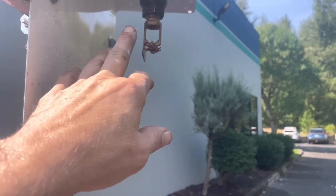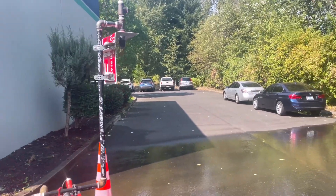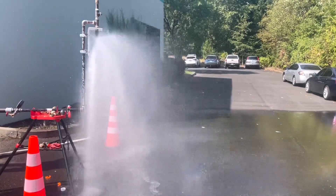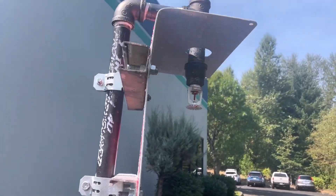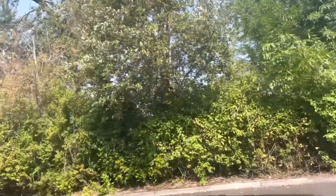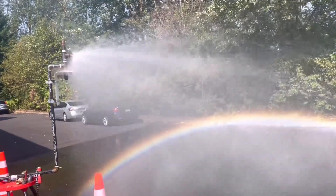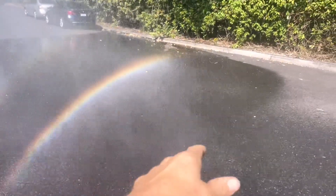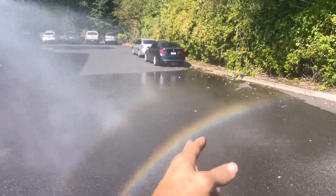Here's what happens if you put a vertical sidewall in the wrong position, or a horizontal sidewall in the wrong position — it's not doing much good. Now we're going to put a horizontal sidewall in the way it's supposed to be, to see if people are paying attention. Go ahead, hit it. We can see it's much more effective out here and you're actually getting fairly good water droplets out to somewhere in the neighborhood of 14 feet.